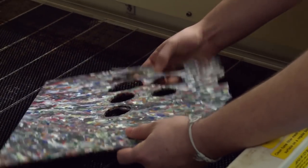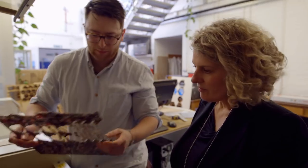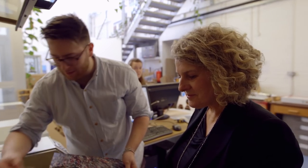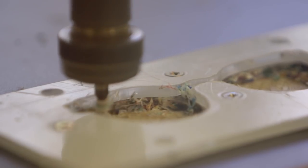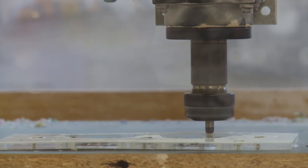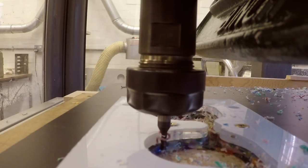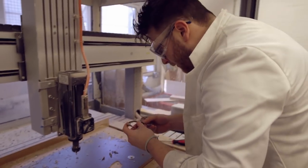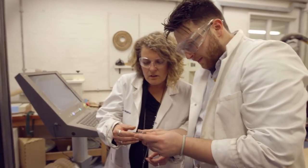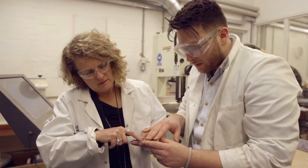As the shapes emerge from the upcycled plastic, they still don't know if the design will work. Even finer cuts are needed to get some lenses to fit, with the computer directing the machine tool to stop within 100 microns. They cut a step in so it goes all the way down, allowing the lenses to be put in flush.